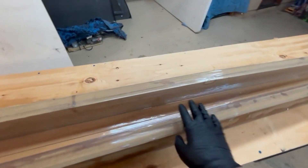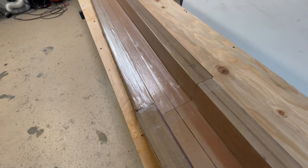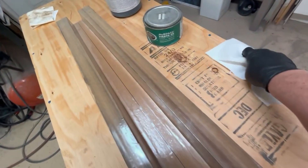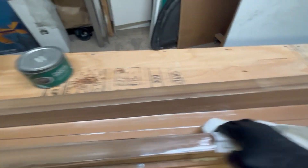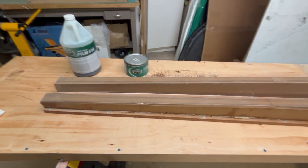I've covered the entire mold with packing tape. This is a cheap, easy, reliable mold surface that will definitely release, and since this is not a cosmetic part I really don't care about the surface finish too much. I've got one coat of wax on this side and I'm going to buff it off and then put on another coat. I'll do that four times total, then PVA, and we'll be ready to start layup.